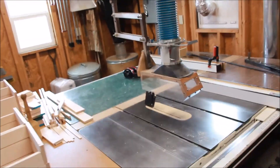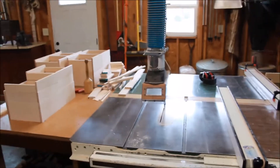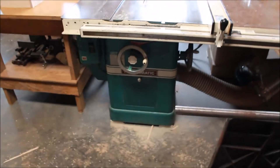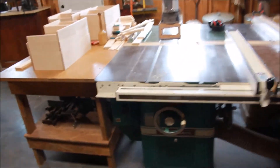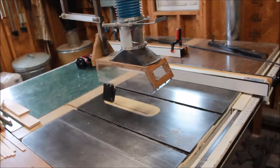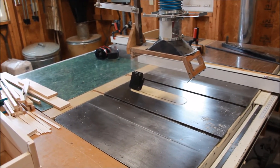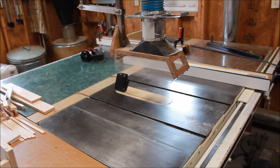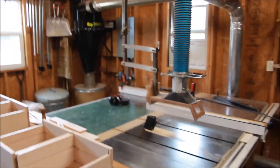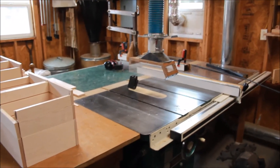With vintage machinery where there aren't shrouds that go right up close to the blade under the table, you're probably going to be disappointed if you just hook up your dust collector to the port below the table — there's still going to be dust spinning off that blade. When that blade is spinning at speed, that dust is going to want to go out, not down where the suction is, because it's moving faster away from the suction. You've got to have something to capture above the table as well if you really want good dust collection. Hope that helps — a little idea to improve your setup.